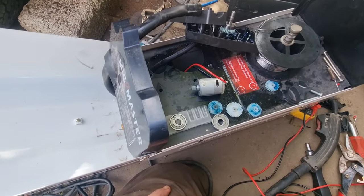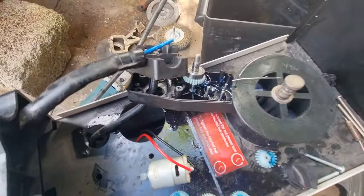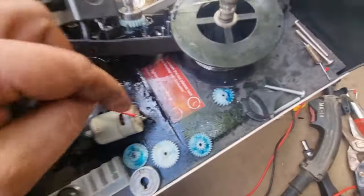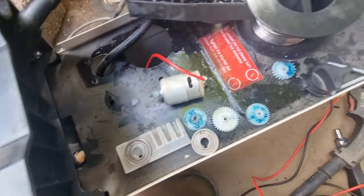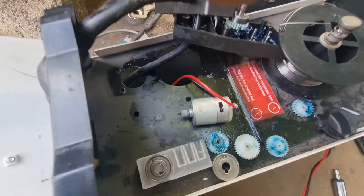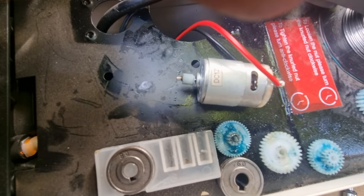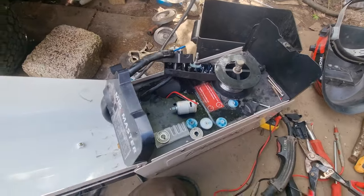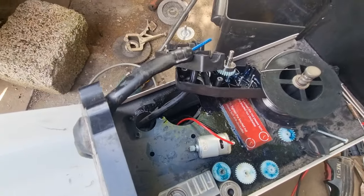I did sort the welder — I powered it up and tried it again, but it's not working again. I think I found the problem though. I took all this apart and got all the gears out. There was a connection that goes to a capacitor that wasn't even connecting to the pin. But now when I press the trigger, the motor spins. So I've got to solder them back on, put some new heat shrink wrap on there, and fingers crossed my welder will be functioning again.